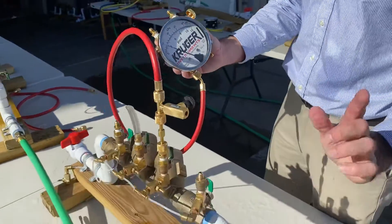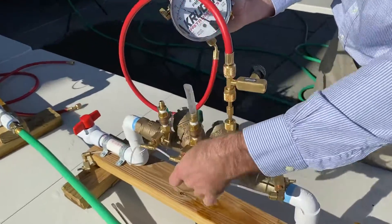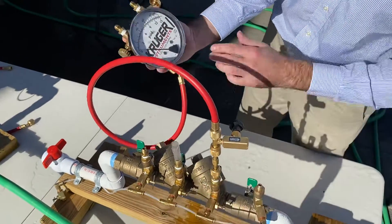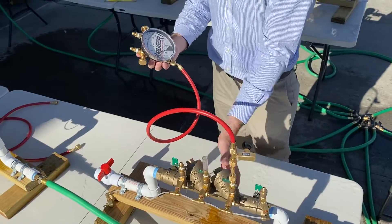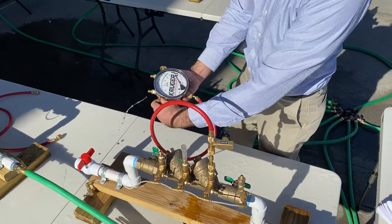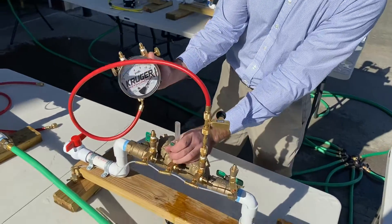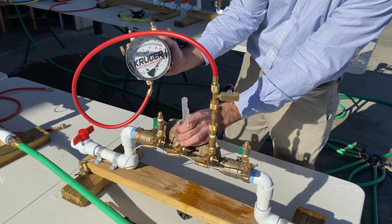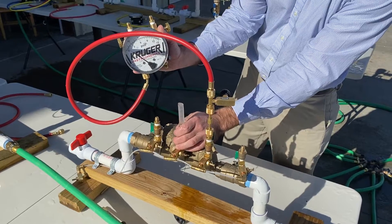Let's say they failed check valve one — they open this one and that one, and the water would keep running and drop to zero. So one of the conditions you're going to come across: when you open that and you remember to keep it level with the top, it'll just drop to zero. That's leaky number one check.